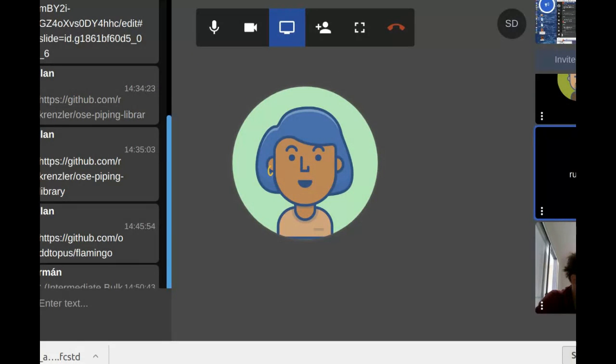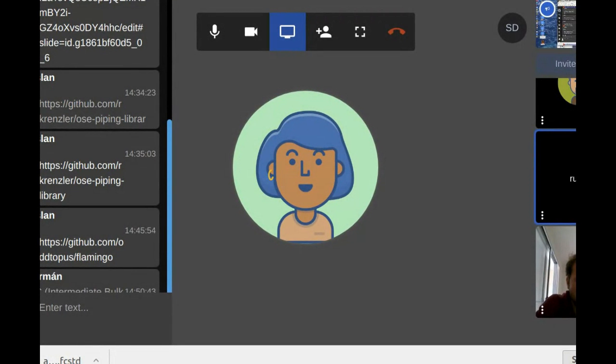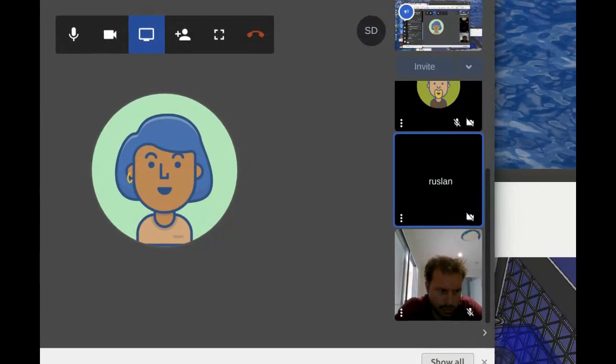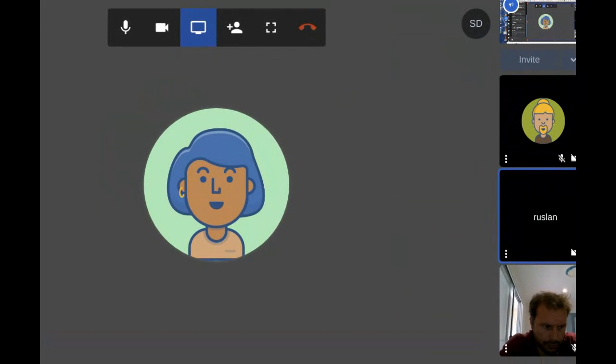I'm not sure we're talking about the same thing, but there's already one thing that they have: filament width sensing. Say you produce your own filament and the filament is not uniform. There's already existing capacity within Marlin that allows you to print faster or slower, adjusting because the filament is not uniform. So that's one thing that already does exist. And we do want to implement that, because once we start making our own filament, you don't really care how good your filament is and still you get excellent prints. So that's something we do want to implement in the not too distant future, once we start making our own filament, which is probably a few months from now.